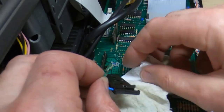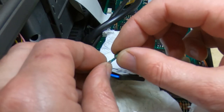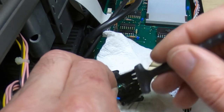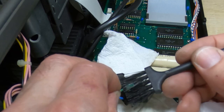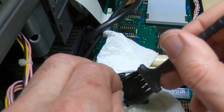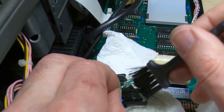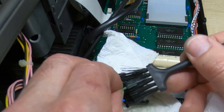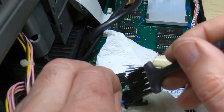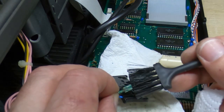What I'm doing now is cleaning the header on the board - it was very badly corroded and will need changing as all the plating is gone. I'm popping each of the pins out of the plug and using a bit of IPA to clean it. As you can see it's got a thick crusty coating of green gunk - that's what comes off the battery that got up into this connector. I'll clean as much off as I can. We might need to change this connector as well, but for now I just want to see if we can get any changing behavior. Obviously if power isn't getting through to the main board it just won't work. Fortunately there aren't too many wires on this connector, but they will need changing - it's not a long-term fix and they'll almost certainly fail fairly quickly.